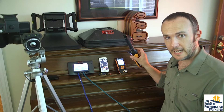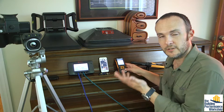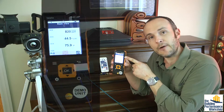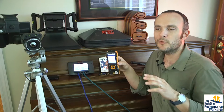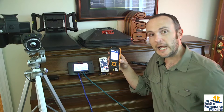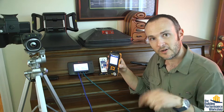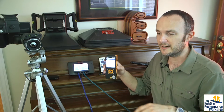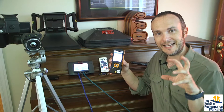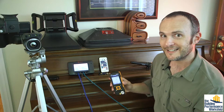We're also tracking carbon dioxide, temperature, and relative humidity in this room with a new Testo wireless probe kit. We can see we're floating at less than 1,000 parts per million of CO2. That's an important number to have in mind as we begin, because as we air-tighten and air-seal this house that number might start going up — in which case we're going to need to ventilate.